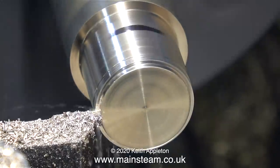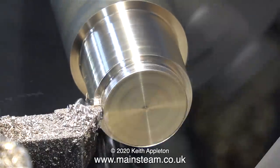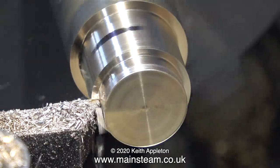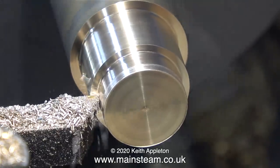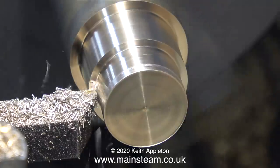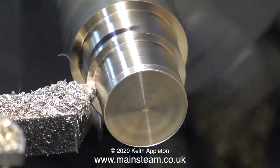For the deep roughing cuts I decided to use back gear — this allows me to take a much deeper cut without chippings flying all over the place. And even though I have a really nice mirror now to get bits of metal out of my eyes, I'd rather there weren't any bits of metal in my eyes to start with. Phosphor bronze and brass produce really hot, sharp chippings. So whenever you're doing jobs like this, wear eye protection — it's essential. These days I naturally wear eye protection and have my glasses on, but glasses are not proof against heavy objects, so always wear proper eye protection when doing any kind of engineering work.